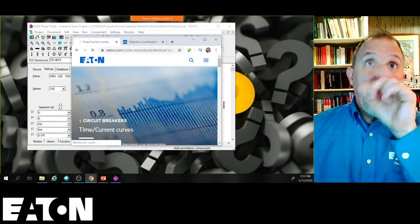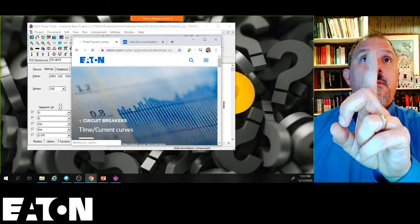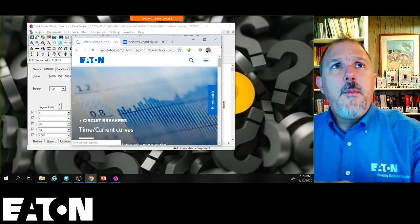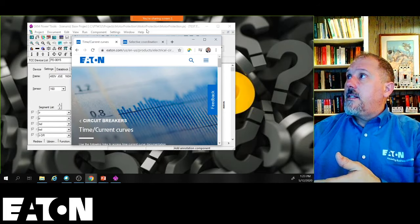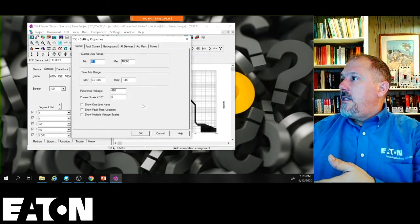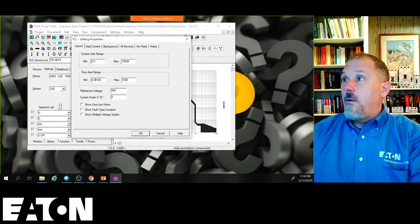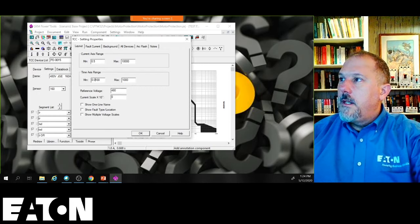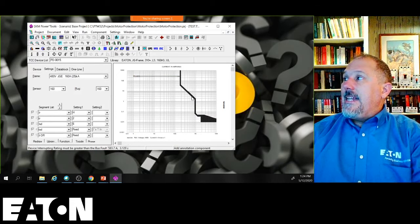SKM won't plot below... they will. They can. SKM can plot below 0.001 seconds. You say they won't. I don't know if you mean they can't. They can, and you can configure that in SKM. If you wanted to, in the TCC settings, I could put that minimum range to 0.001. I can take this down to 0.001 if I wanted to, but the data in the database would